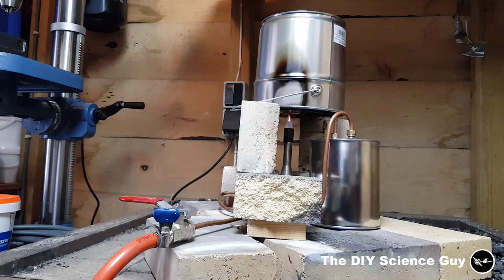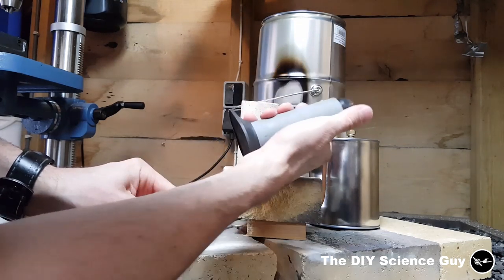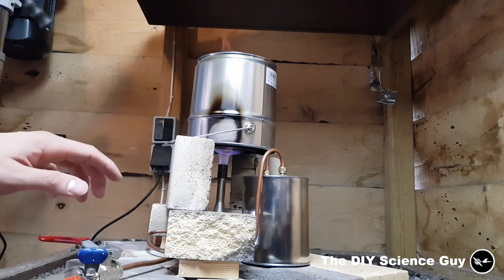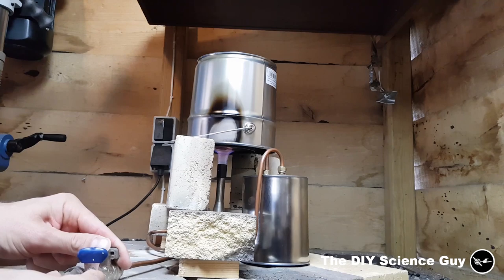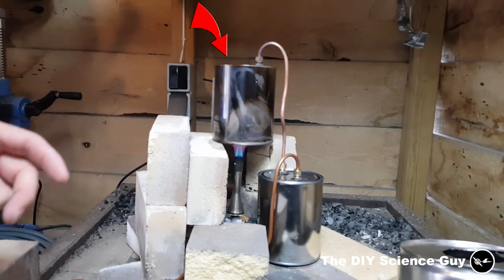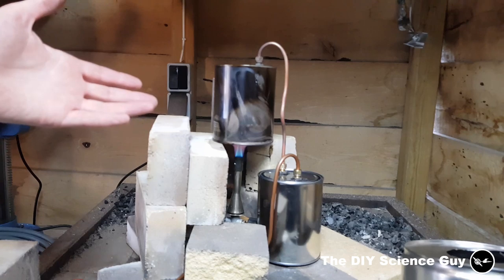At least this is a proof of concept. As you can see, it still dies down for a while — that's because there's too much cold air running around it. You can see this big flame up here, which is all just wood gas burning. I'm going to put a couple of bricks around it so we have less cold air running into the whole system. The lid popped off and that's why it couldn't keep itself going. But now, even without the can around it, it still keeps firing itself up. So it's actually better than I hoped, because it's producing more and more gas.